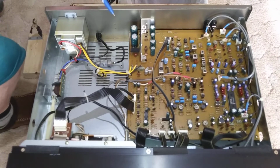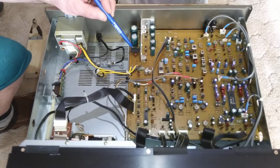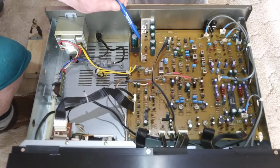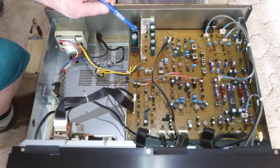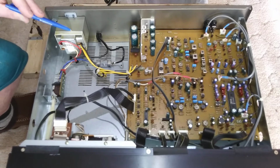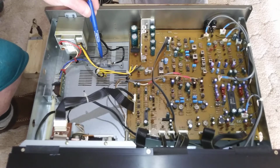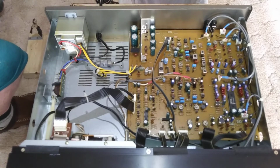Alrighty, so see the bridge rectifier here, and sometimes it has 4 single diodes. This is a bridge rectifier, and the power capacitors and the 2 voltage regulators. If one of these go bad in a shorting condition, it can get this transformer here very, very hot, and the windings can short out. And while it's taking time to blow the house fuse, this cord can be getting very hot and it can melt and it can short out and start a fire in the house. So this fuse is nice and small and it will blow this before a fire starts in your house.